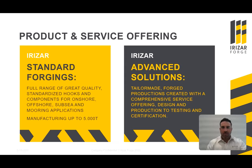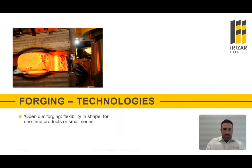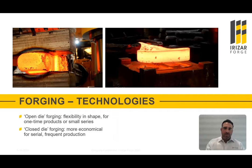Our advanced solutions often result in customers working directly with our engineering teams, which is where we excel. Being a forge, we excel in both open die and closed die forging. Open die forging gives us flexibility in shaping the material and is typically used for custom one-time productions or very small series runs. Closed die forging is for our standardized, frequently used, high-production-run products — this significantly reduces machining and grinding, which is more economical for our customers.